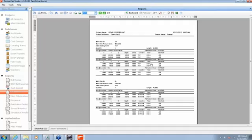We've got a tool set up out here. We've labeled all of our drills, which makes it easy to find the proper drill. The drill we're using here, just a straight drill, we've labeled as a D10A, which is equivalent to a .228 diameter hole, and that's the clear hole we're going to need for the screw spline material, clear hole going through the die. And it continues through every one of our pieces that we're going to cut. If you'll notice here, it goes through 3 and 4, each of the different dies we're going to cut, how that's going to be fabbed. This is one of the reports that we get out here.